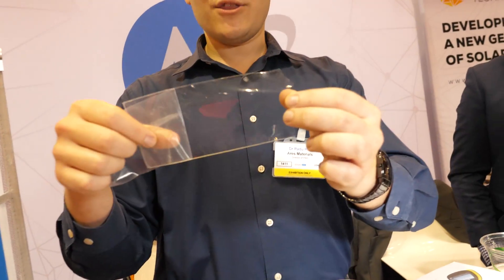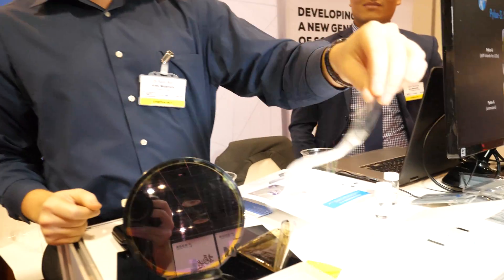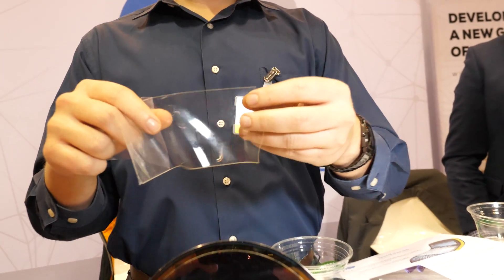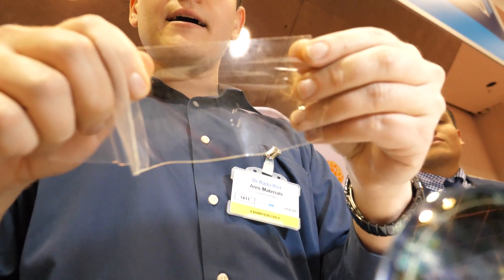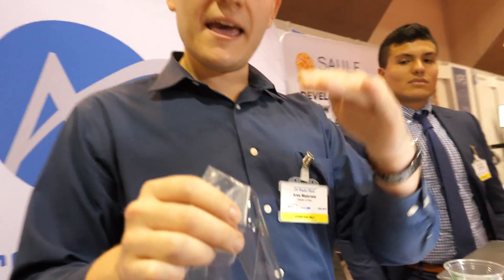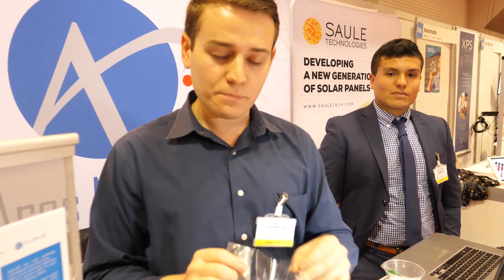This one isn't optically transparent, but these are the transistors using IGZO. This is another one of our materials called PILUX W. This is an optically clear adhesive for use in protecting your display. It's also going to be a shock absorber when you put it in between the display module and the cover lens. So if you drop something on the glass, this will protect it from breaking the actual pixels.